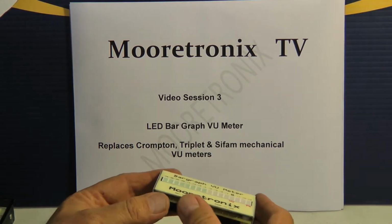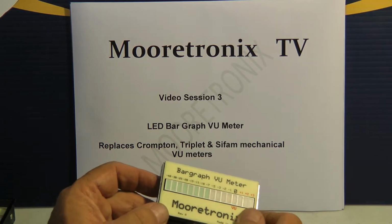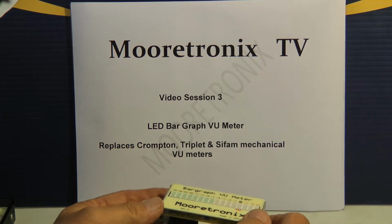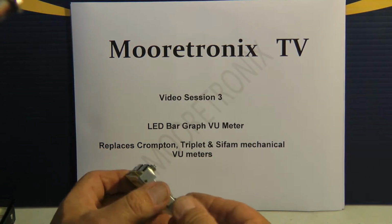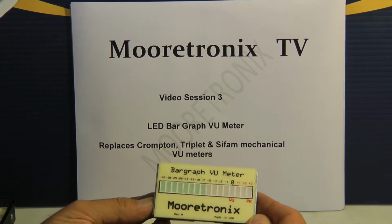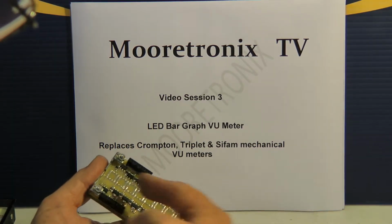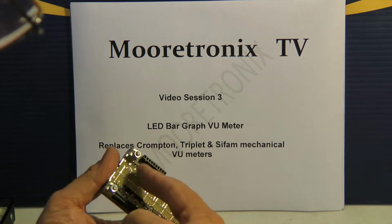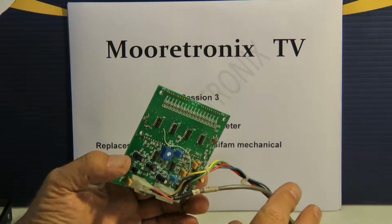There is a basic stainless steel plate that forms the chassis for the display assembly. We have a polycarbonate overlay that attaches to that plate. Then we have some screws and spacers and these special brackets that are used to bolt the display assembly to the VU meter bezel. There are 4 connectors on the back. These are the meter driver transistors for the LED displays. And this is the meter driver board.